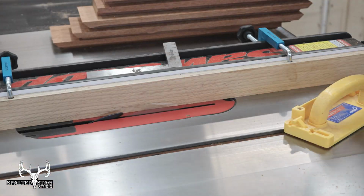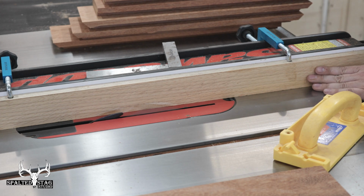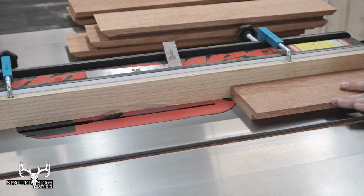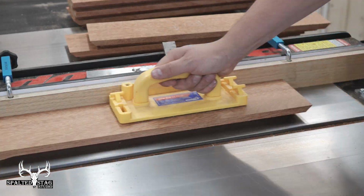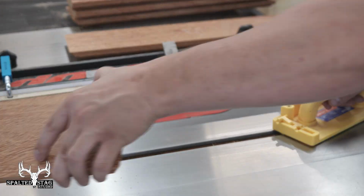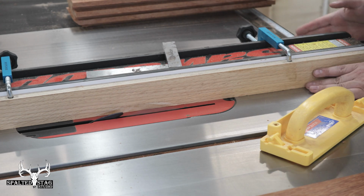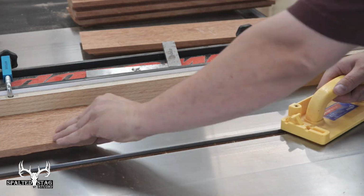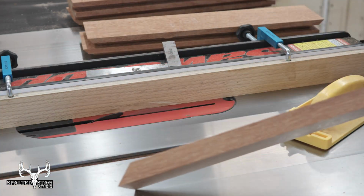Normally I wouldn't use 3/4 inch plywood for this, but it is going to support the whole weight of this table, and we're putting a fish tank on it, so it needs to have a lot of strength. Again, a dado blade would have really helped in this spot, but like I said, I really don't like mine, so I just use a flat tooth rip saw blade.